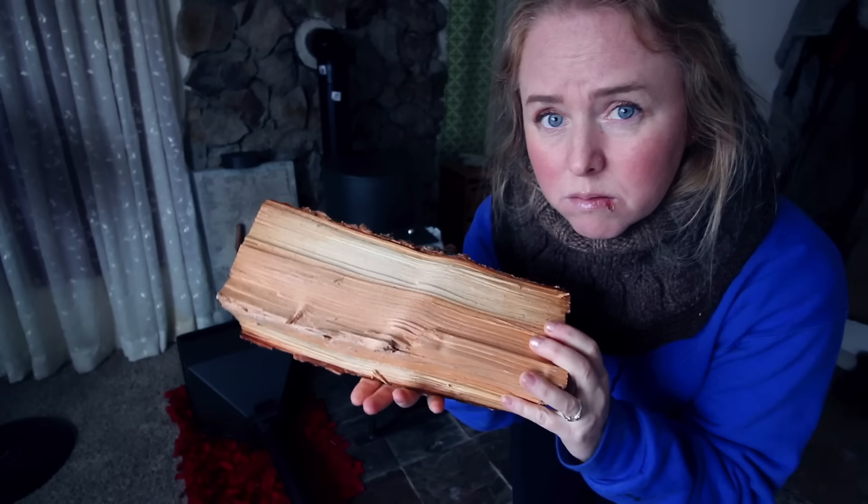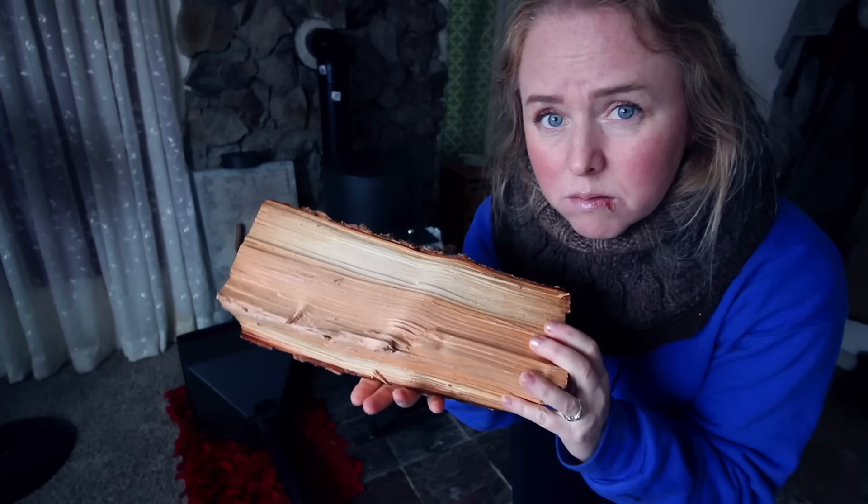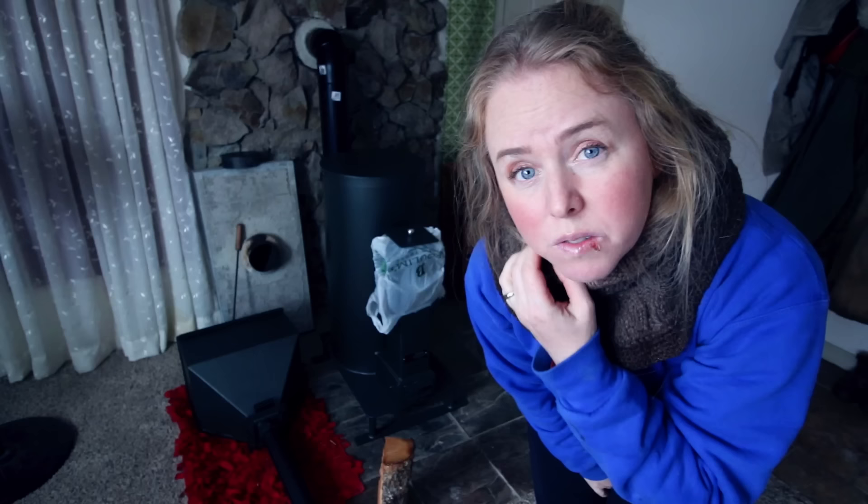This is not what this stove is meant to burn. This is cordwood — that is not kindling and would not fit down the feed tube. So John has decided to use pellets for this first burn, and we're going to let it go. I think it's a three-hour burn that you're supposed to do just to make sure it's all the way burned off and cured.